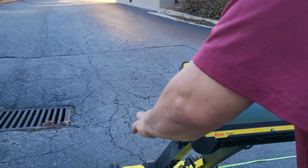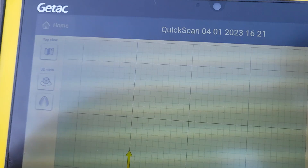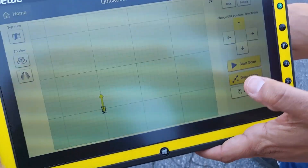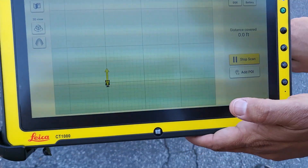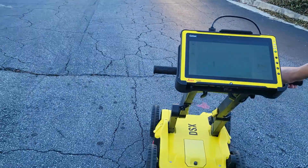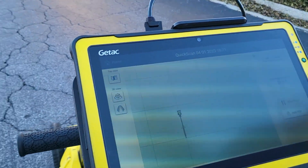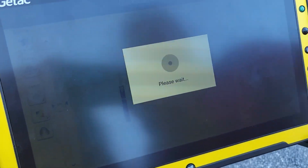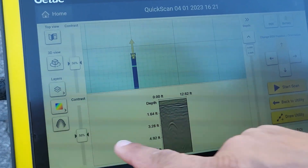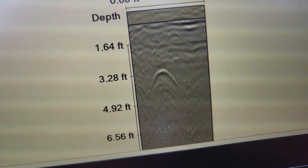We're going to roll it right up. In our case we'll start at nine feet. It's literally ready to go — once you press Start Scan and start pushing, the GPR starts to roll on your screen. You can go as far or as little as you want; it's completely up to you. We'll stop somewhere around here and press Stop Scan. Once we press Stop Scan, it's going to load our time slice. If you want to see a profile view, just click the little hyperbola button and it'll show you the profile. Zoom in a little bit and you can see a great image of the drainage pipe we're going after.